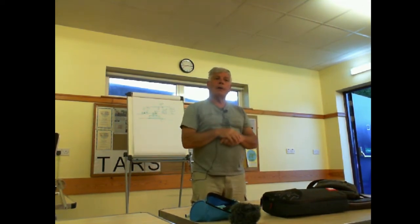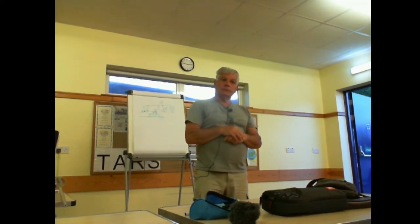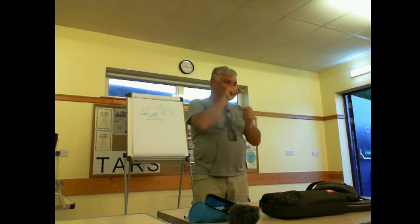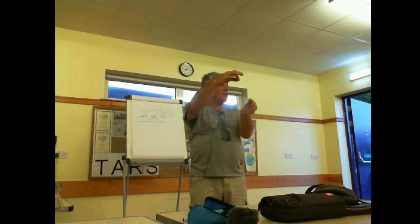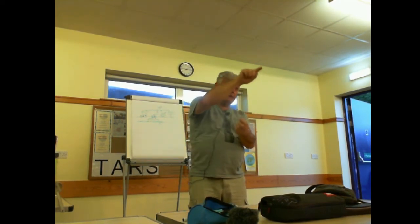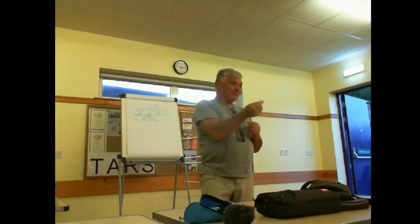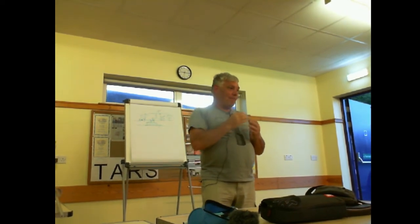Oh no, this was installed by an electrician. So what have you got to do? You've got to have lots of bits of wire. The coax cable comes in, and then he's got the earth going in where it's meant to go, and then the live side is stripped back, and it's about this long. And he's gone all the way round inside the box, and then connected it to the centre pin. And what this goes to show is that this length of wire is phased into the system, and basically it's wiping out the TV signal, the RF point.